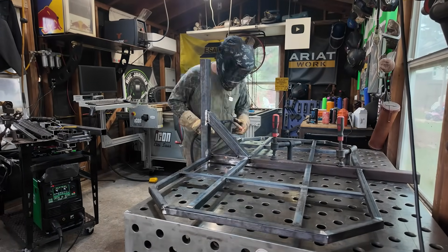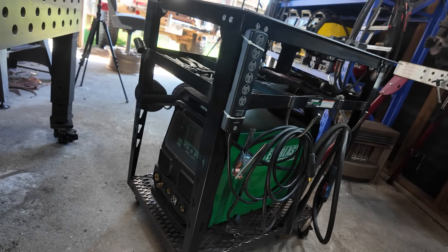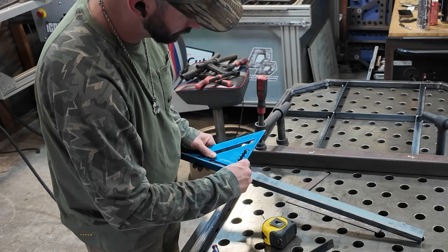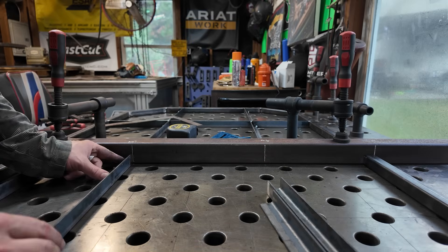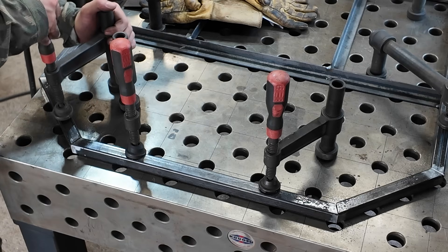One tool you really need to focus on as a welder-fabricator is the welder itself, because you can't just start slapping and tacking stuff. Layout is optional but I think it really helps — look at your plan, find the parts, lay out the marks where other parts intersect, and see if something's going to work before you've even put a tack on it.